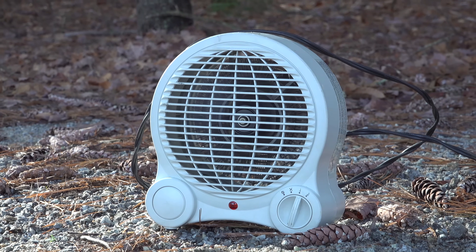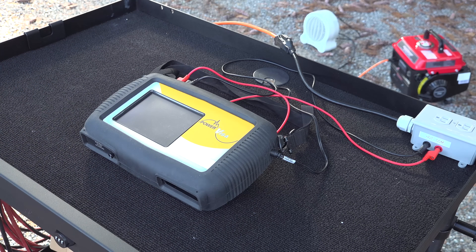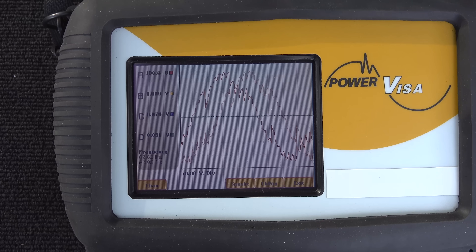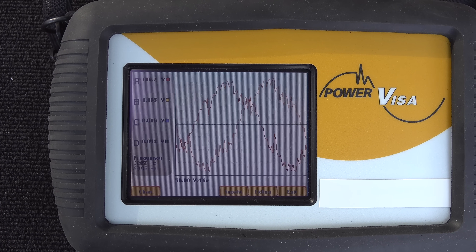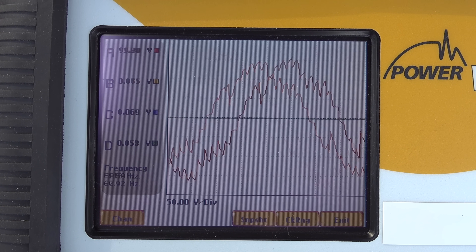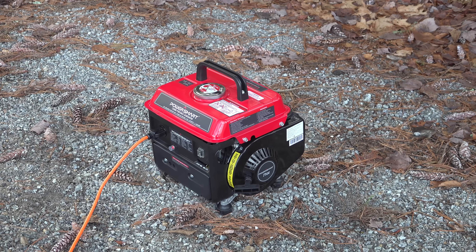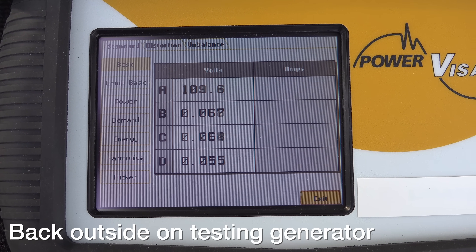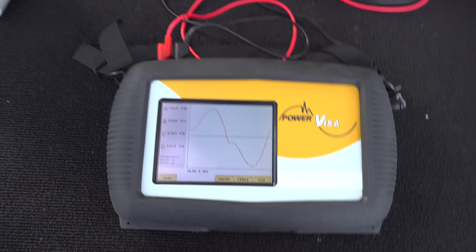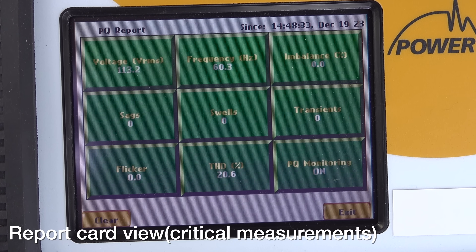This heater was working just fine, but now it's time to use the analyzer to see the type of electrical output this thing is really putting out. The analyzer goes in the middle of the electrical connection so I can plug my heater into that special gray outlet, and now the analyzer gets fed directly from the generator. The output here is not looking very good — the voltage in the upper left is kind of all over the place and what's supposed to be a sine wave is super jagged. Compare this to what your electrical output is like in your house — the curve is looking much smoother and the voltage is completely stable. Then something surprising happens when I turn the electric heater back on: once a load is applied, things completely change. While that curve isn't totally smoothed out, it is a huge improvement over what we saw when the generator was just running idle.